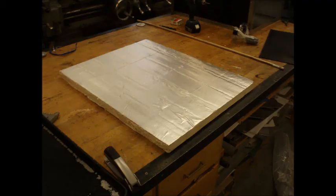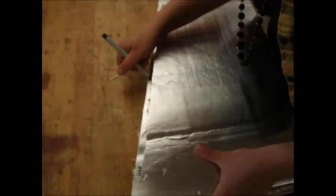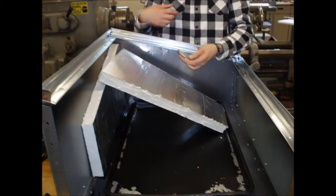After all but one side of the oven is put together, it's time to prepare the R-Max. The R-Max must be cut to fit the inside of the oven. Be sure, when taking measurements, the space the R-Max takes is accounted for. Measure out the R-Max to fit the base. When you measure the walls, account for the difference in height due to the R-Max taking up space. Once the R-Max is cut to size, make sure you have the dimensions right by fitting it in the oven.